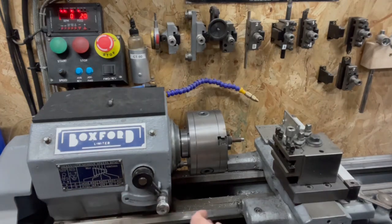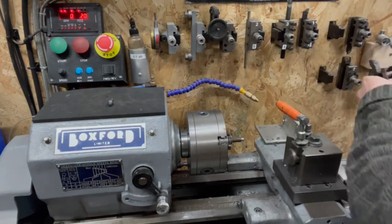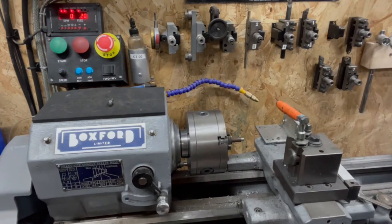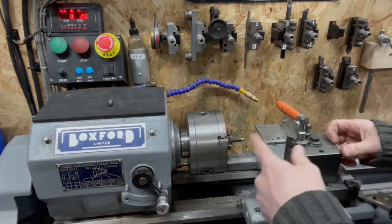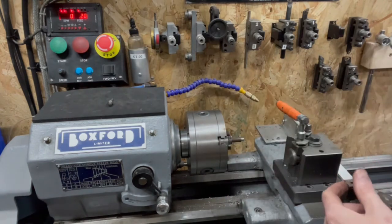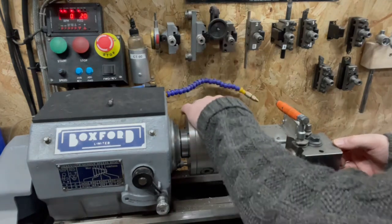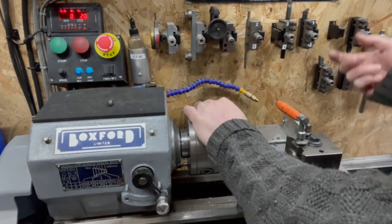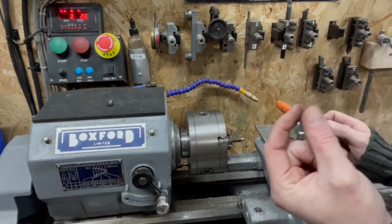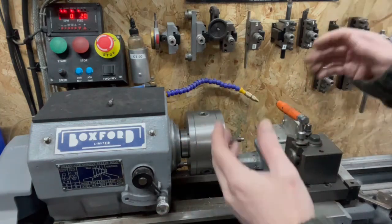Yay, my favourite. No, it's not. Especially not when it's only, what was it? 5.8. Less than 6 mil of threading. So I know a lot of people do this in reverse, threading tool upside down, work away from the stock. We could, but with this machine the chuck is actually threaded on, so run it in reverse, there's a chance of it unwinding. I'm machining the tiniest thread in the world, so the chance of that is very minute, but my tool heights are set.